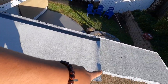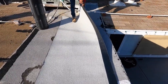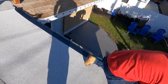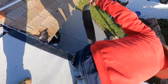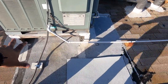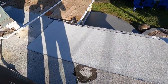I'm going to cut the roll, go from here to there. I'm going to move it up a little bit. I'm going to cut the black backing because when you put the actual roof on, you overlap this roll on the black so it has a good bond to it, but we don't need it because it already has torch on it. We're not putting another roll, so it doesn't look bad. We're going to put a roll here and then put a roll going across this way because the leak is coming from about right here, but we want to make sure it covers everything.